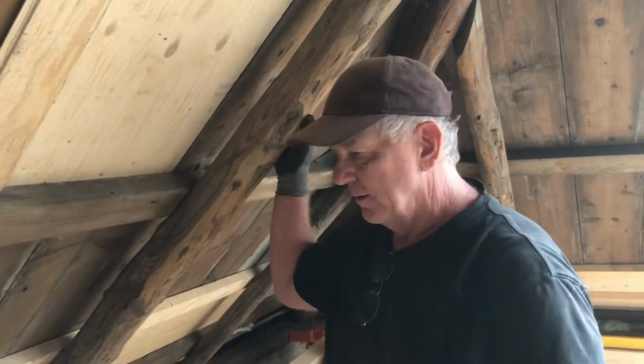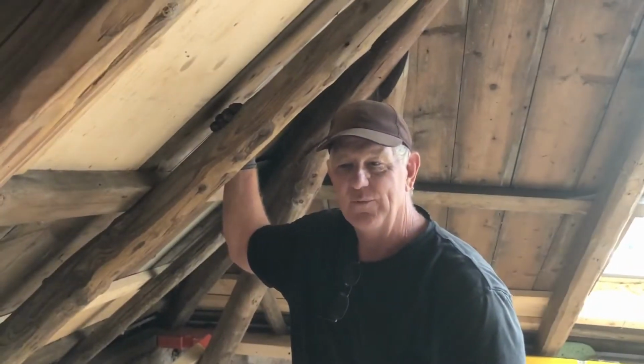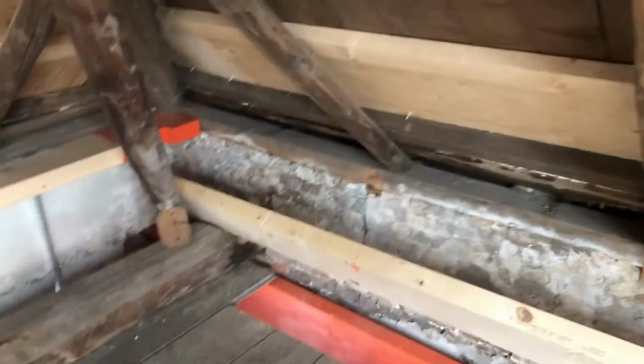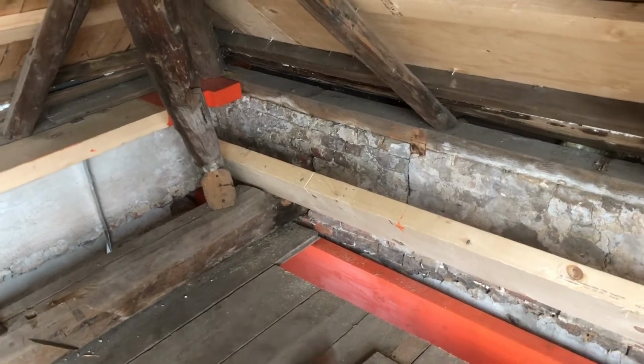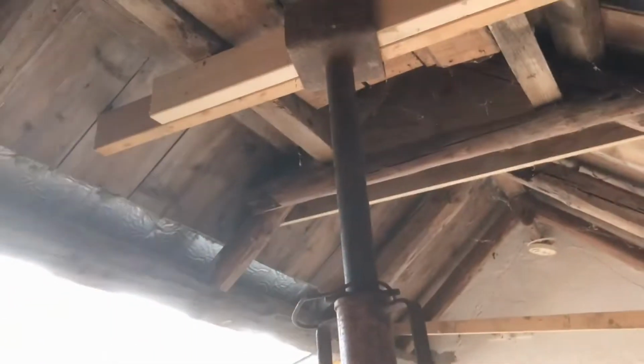Cool. And then when this is in, we're done with the U shape. I think we can take the floorboards off. Then we can get the beams. I don't know what's keeping this up, because the beams are really rotting at the end. They're very rotten at the end. Everything basically is resting on that beam there. Yeah, with that big beam on, and then we create a support underneath that holds up the whole roof, and then we will let that go at the moment when this beam is mounted in place.